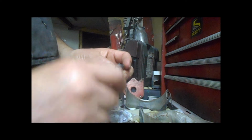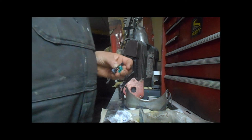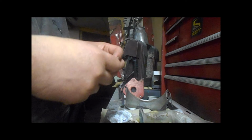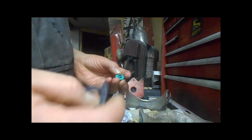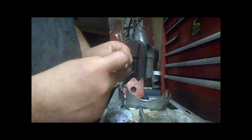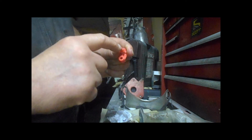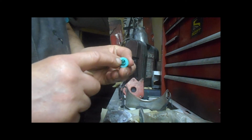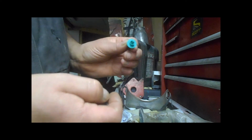And the other thing you have to think about is the water situation. If you have hard water, soft water. Here we have really super hard water, and usually what ends up is you get a buildup on the end here. You just take your fingernail, you gotta scrape the end to take a bit of a cap off there, and that cleans it. And the other problem too, you get dirt in here, and then it doesn't want to spin.